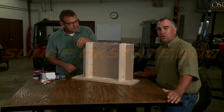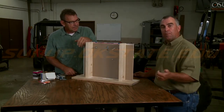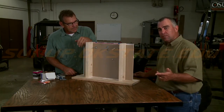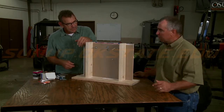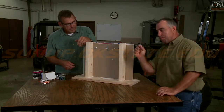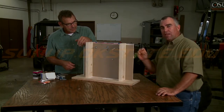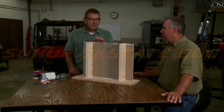You've got a lot of choices with drywall anchors. The first key is to think about what you're going to hang on it, how much that weighs, and where you're going to put it in the wall. One last tip: if you're going to try to use a cordless drill, you really need to be careful because a lot of these anchors need to be set into the sheetrock on the wall side, and it's really easy to make them spin with a cordless drill.